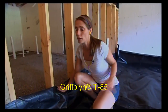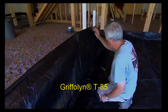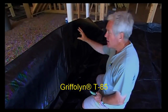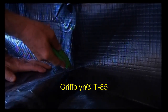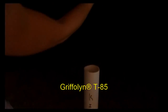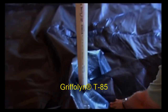If you had regular plastic laid over these rocks and walked on it, it would cause some holes and probably some leakage. Now once you get this stuff laid out and you hit obstacles like plumbing pipes, you could just slit right up and bring the material around, but we want to keep the number of protrusions and slits in this material at a minimum so you don't have gas leaking through. Instead, I'm going to make a small hole in this area, lift it up over the top, and then we'll come back and install some boots — it's a pretty good process for sealing these up.